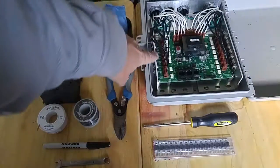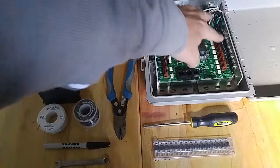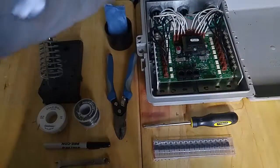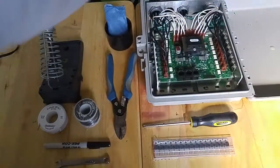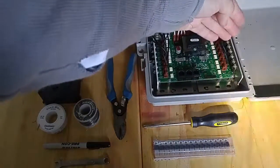There are technical terms for this — I just call it these ICs are leaking. I worked in TV repair shops for many years, and that's the term we used for an IC that's not working 100% or not cutting off 100%. If it's anywhere in between — 20%, whatever — we call it leaking.